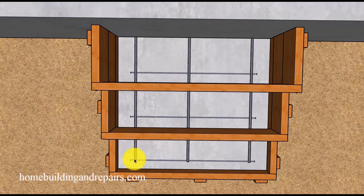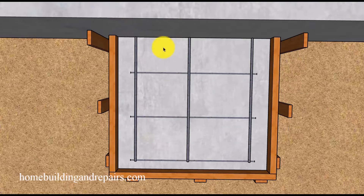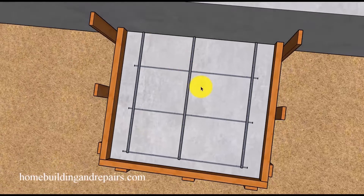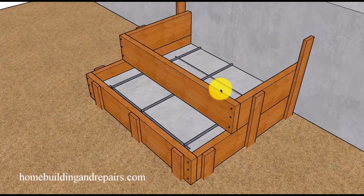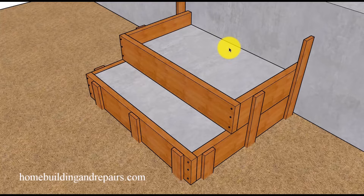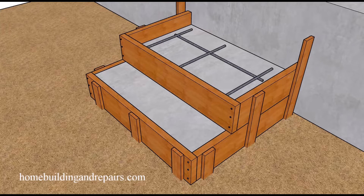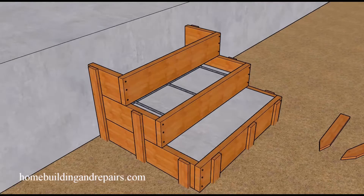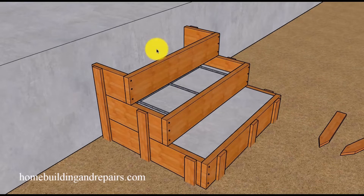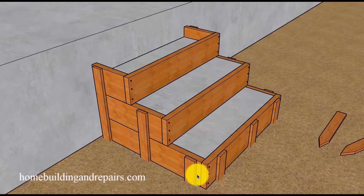Since the porch in our example has a concrete footing, I can run the rebar up against that concrete. Lay one row first and the other row on top — it doesn't matter if you reverse this, and they don't need to be tied together, though you could use wire. Then repeat the process by setting the rebar on top of your next layer of concrete. Pour everything all at once — not over two or three days — then strip the forms and finish the concrete.